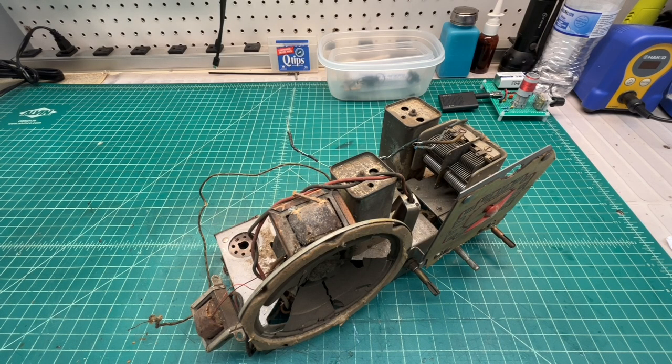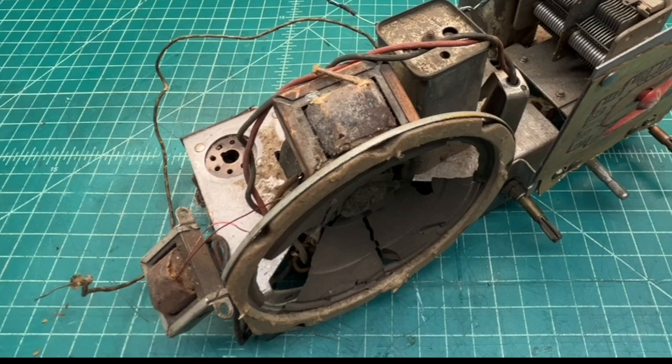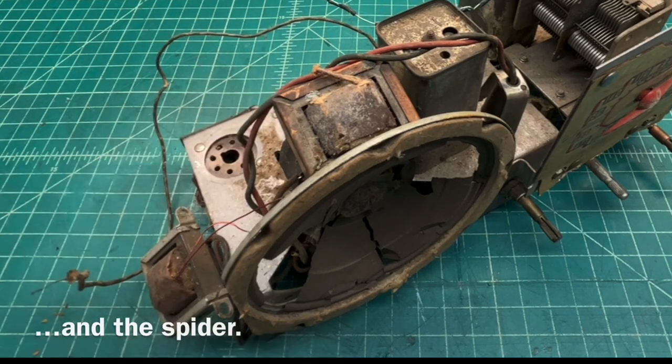It's kind of a hybrid chassis, but it will be easy to work on. It's a superheterodyne 5-tube complement — I'll list that in the video description. As an exercise, I'm going to try to re-cone the loudspeaker, which assumes the field coil and voice coil are actually good.